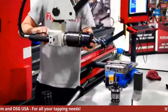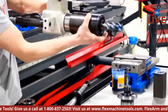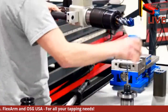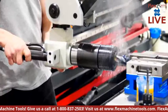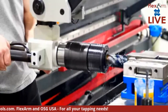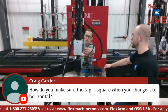Popping in the big inch-and-a-half tap, kicking the power unit on, putting it in gear one for high torque. Get some lube on there — sending it down. Two inches deep — you can see that clutch working, pulling tons of torque. Just more proof: it doesn't matter whether it's vertical or horizontal, whatever the capacity of the specific arm — it runs through like a hot knife through butter.